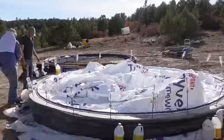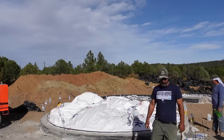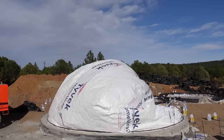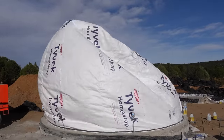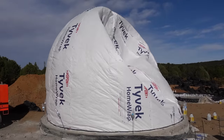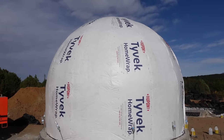The aircrete I used has a special ingredient that thickens the cement up, allowing you to trowel it and bull-float it right after mixing. It gives it density and also allows you to do taller pours. That's a real key ingredient to my aircrete mixes — I'm able to get a thicker aircrete for taller pours. We just poured the aircrete and were able to use a bull float on it; with normal aircrete, the bull float would just sink to the bottom.